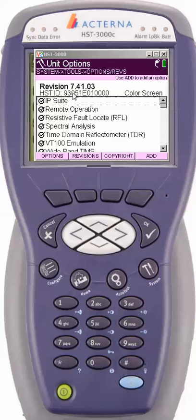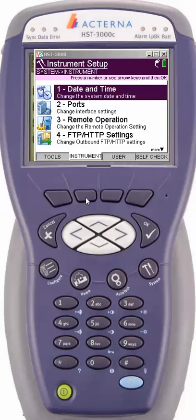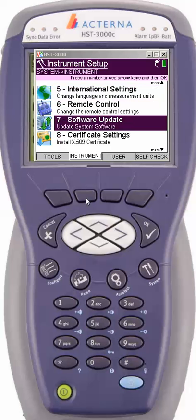So we're going to say my meter doesn't have the latest firmware. To upgrade your meter, real simple — I'm just going to go to the cancel button right here and then go to Instrument. From Instrument you're going to scroll down until you get to where it says Software Update. Real important information here: the meter has to be plugged in to the power supply. You cannot do this off the battery — the meter won't even let you attempt it.